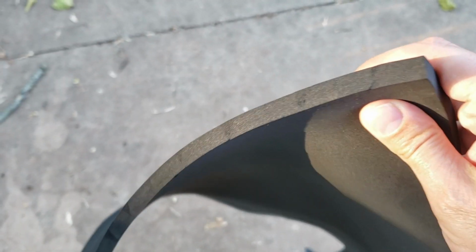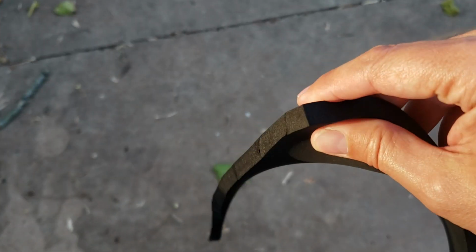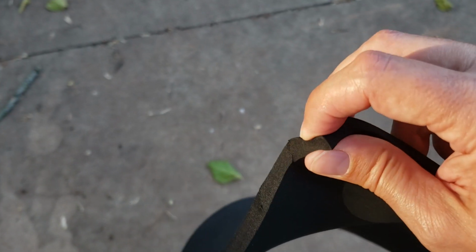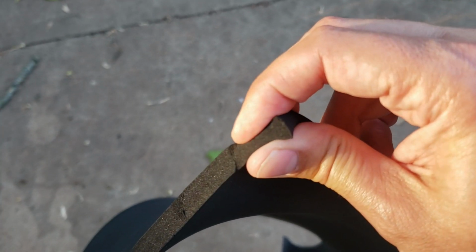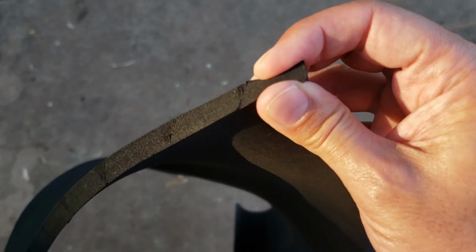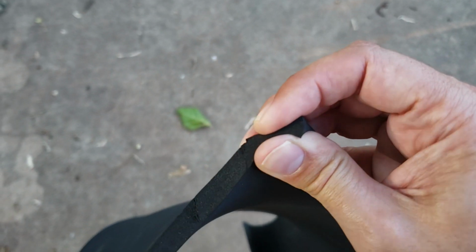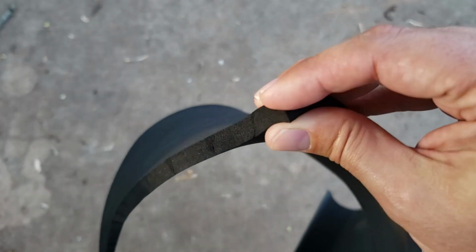This is a 3/8 of an inch thick foam. It is a neoprene foam gasket, I believe. And like I say, very, very soft. So as I screw the hatches down, it's going to compress in and around those spots in the deck where it's got the raised decking, and still sit up above the surface like it needs to.